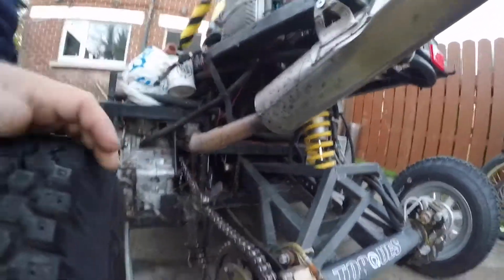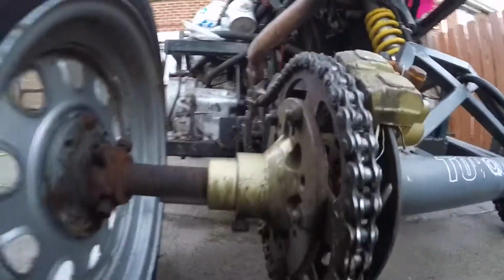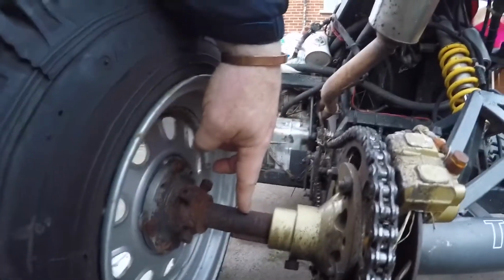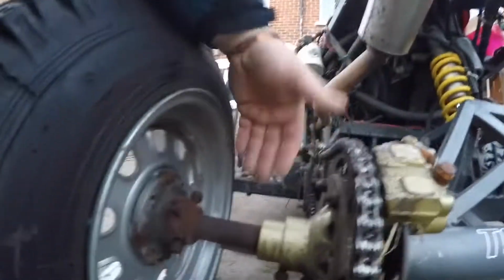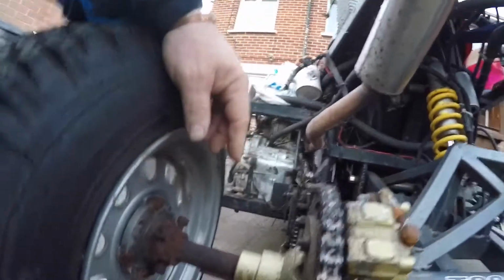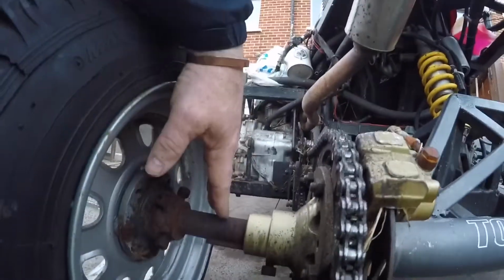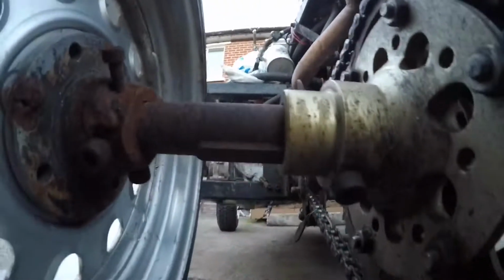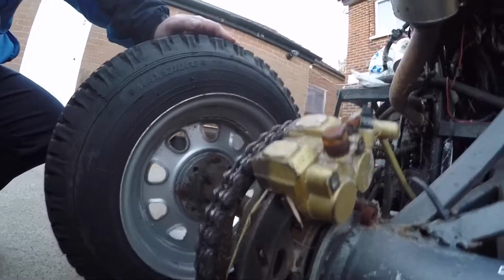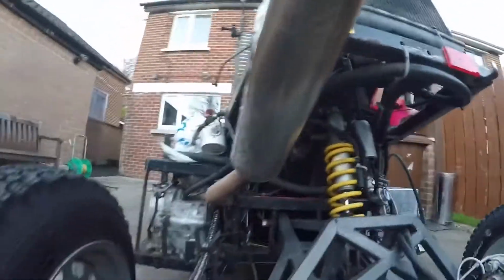Probably while I'm here, I'll mention the sprocket carrier I made. This axle is not mild steel. It's, I forget, B32 or something like that. It is axle grade steel, kind of the hardest steel you'll get that can still be machined, because there's a keyway that'll actually go into it. Most of the buggies have a brake on that side there. A big 4-stroke engine has a lot of engine braking, but I shoehorned in another brake there.